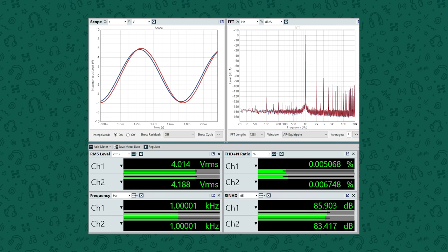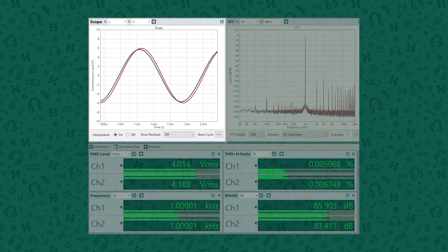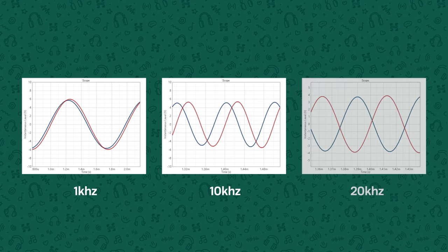So at this point I decided to measure the EF400. I always do my listening before measuring because I don't want the measured results to bias what I hear subjectively. And in this case, my ears weren't deceiving me. Just quickly playing a 1kHz tone, you can see that despite the THD+N level being reasonable for an R2R DAC, the outputs aren't aligned — they're not in phase. This means rather than the left and right channels outputting at the same time, one is slightly delayed compared to the other. And the higher in frequency you go, the worse this gets. By the time you get to 20kHz, the outputs are almost entirely out of phase. So that would explain the wonky imaging and sense of direction on the EF400.